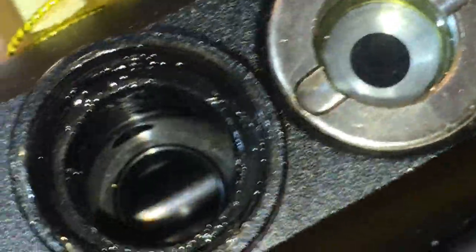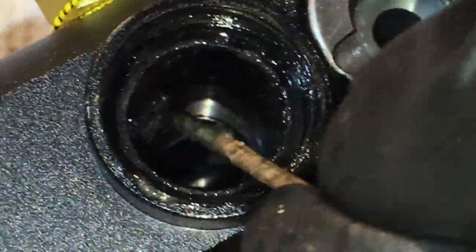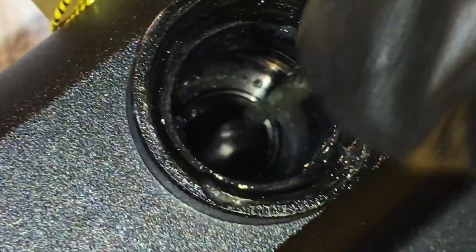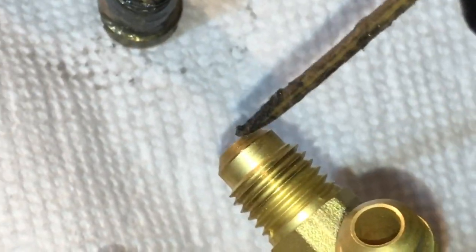You can see the refrigerant passage — I'm sticking my toothpick in the hole. That's the refrigerant passage. And this little area right in here — here's where the refrigerant goes down inside, down in here. This is your manifold that's drilled out inside. That little hole there is your hole that goes through your stem, so your passage can come out and your refrigerant can come out here.